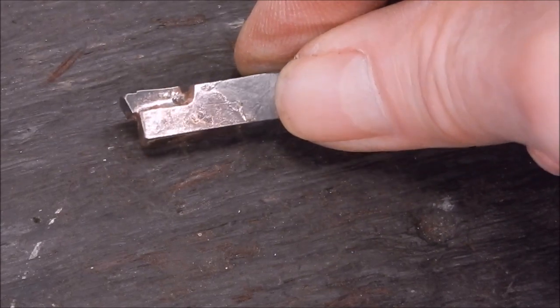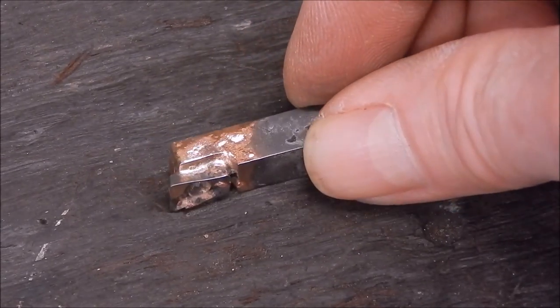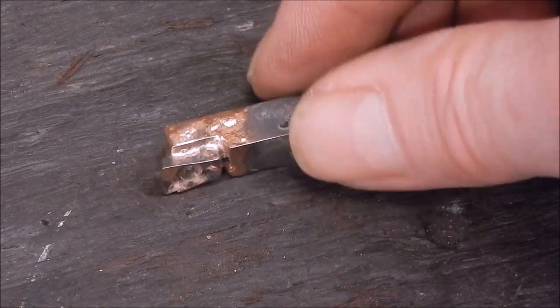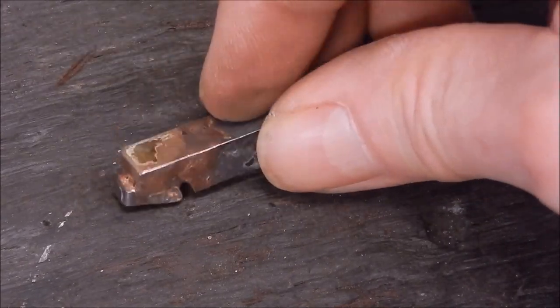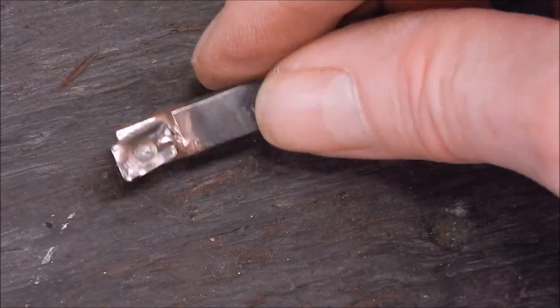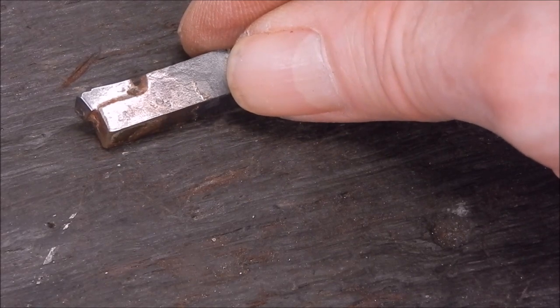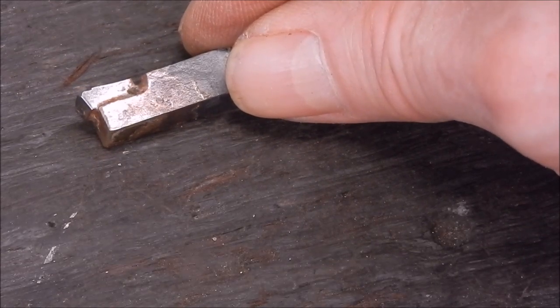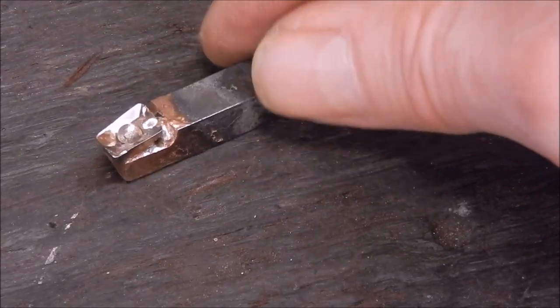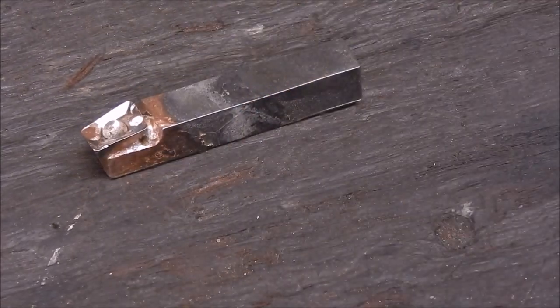Okay, it looks like it's bonded pretty well. Certainly as good as bronze, just bronze manganese bronze rod. Took a lot more heat. I mean, copper, you know, it really takes the heat. But it's doable, so if you haven't got a bronze rod, or you're too tight to buy bronze rods, you've got gas, well. So I'll sharpen it up and we'll give it a go.